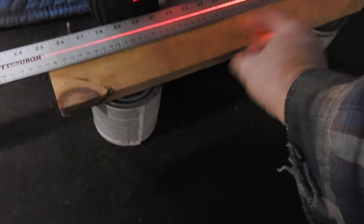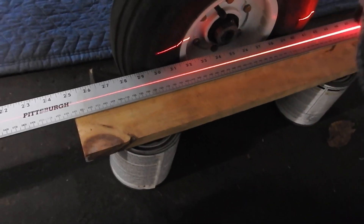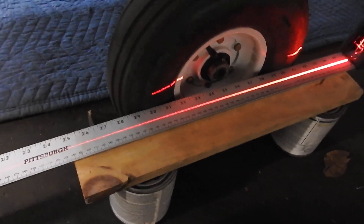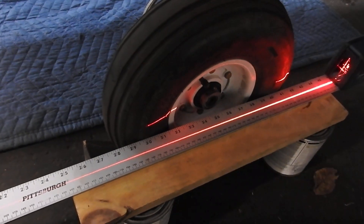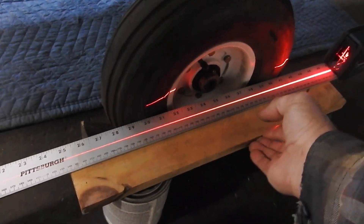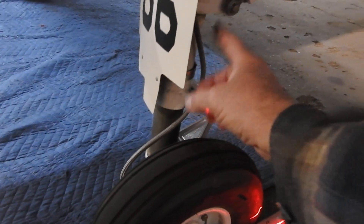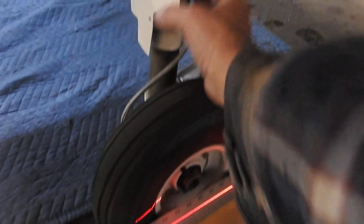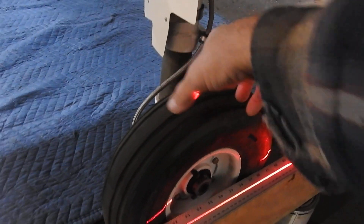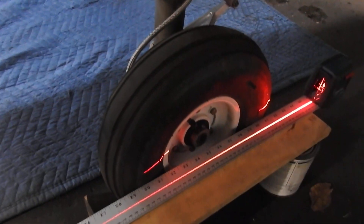So that laser was set up to measure, and then I take this board, bring it over and put it right there against two quart cans of paint and a piece of wood. After I make adjustments I bang it back and forth. There is a little play in these things because building this stuff from scratch you can't make it precision — especially when it's all welded up. Everything warps, so the strut jiggles a little and there's a wiggle in the toe-in, toe-out.